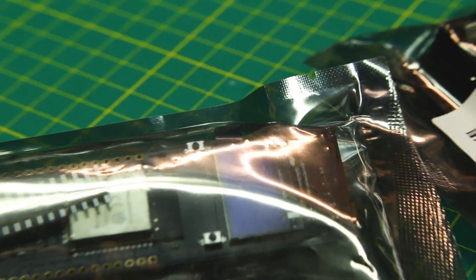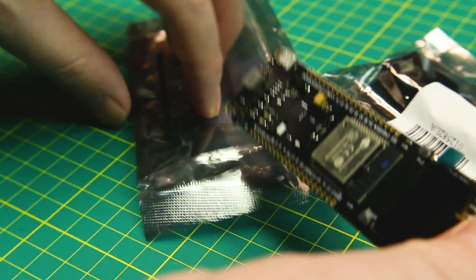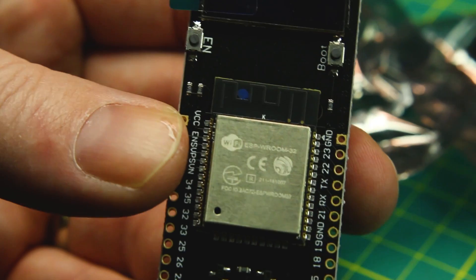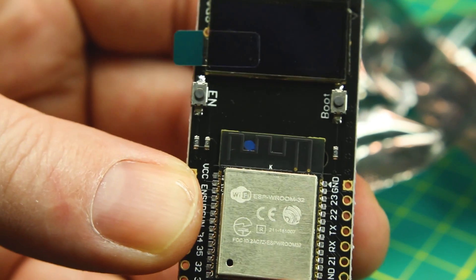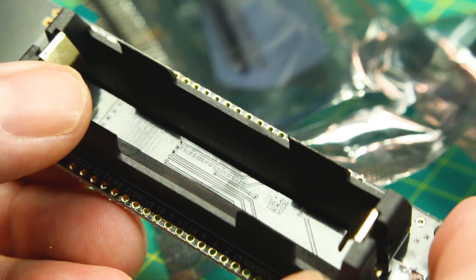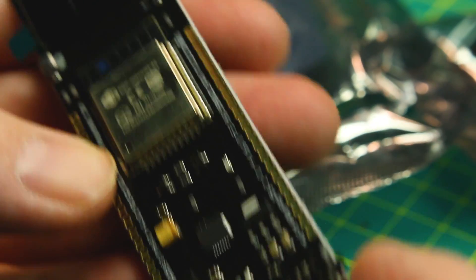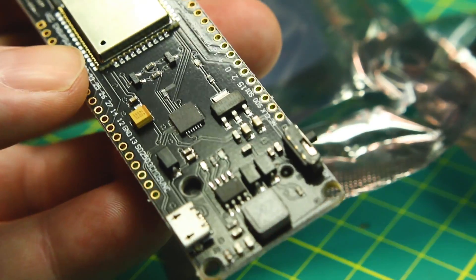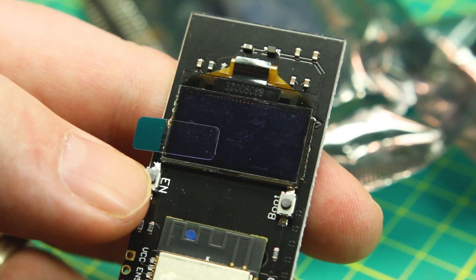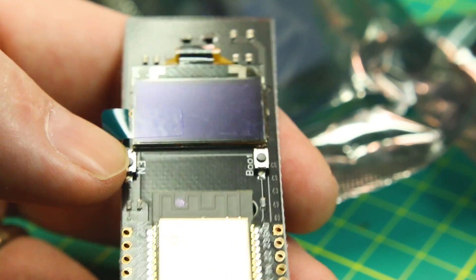Next out of the box, these look like microcontrollers — yet another microcontroller I've never had on the channel. They are ESP32s, with an ESP32 chip on board. They take an 18650 battery on the back side with full breakout, power on and off, and charging capability from USB. There's also a nifty little OLED on top with a boot button. Very cool.